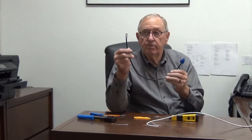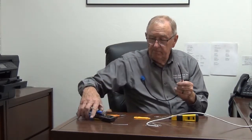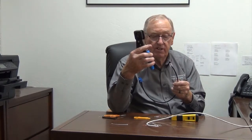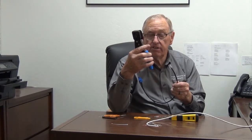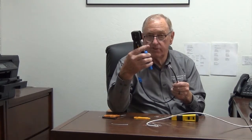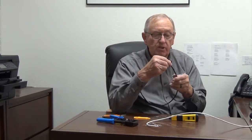If you can't justify buying a crimp tool with a cutting blade for the EZ connectors, you could actually crimp with a regular crimp tool and then use a very sharp box cutter, knife edge, or razor blade, and carefully cut the wires off individually, making sure they don't touch each other, because they all have to be independent.